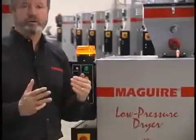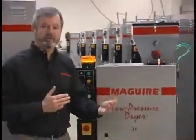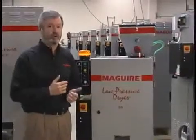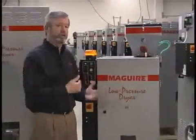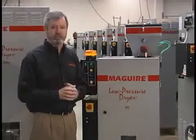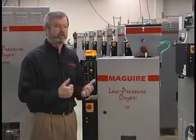First of all, if you're drying polycarbonate with a desiccant dryer, the material manufacturer will tell you that you have to dry that material for 4 hours. With this device, you only have to dry that material for 40 minutes. That speed is very obvious as far as it can help your productivity.